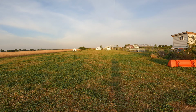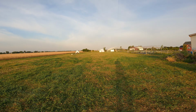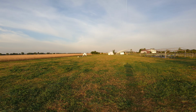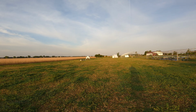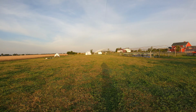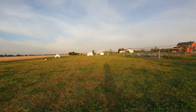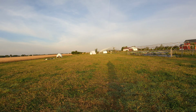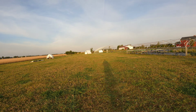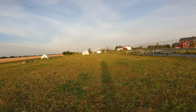I suppose if you were a crew building these buildings, you'd show up and everything's laying over here by the project. A couple guys building bows and some other guys putting up purlins and stuff. I bet they get that going pretty quick. We've been getting 4 bows a night in about an hour and a half. So we're doing pretty good for us.